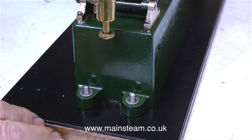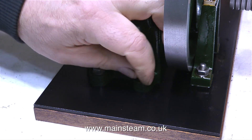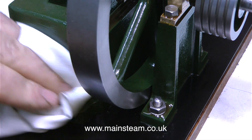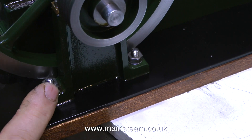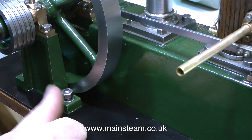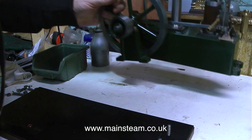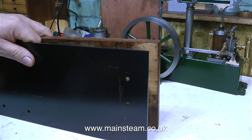It's time now to undo all the nuts and bolts that hold the engine to the bed plate. Most of these nuts are very easy to remove — as soon as I slacken them off with the spanner, I can just spin them off with my fingers. But some of them are not quite so easy, as the bolts were spinning round. So what I had to do was hold the engine over the edge of the bench, use a screwdriver from underneath to hold the bolt, and then I could spin them off with my finger. Now that the engine's not attached to the bed plate, I can carefully remove it and put it on the back of the bench, being very careful to support the flywheel at all times.